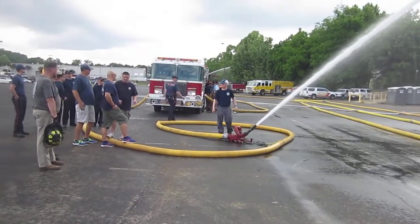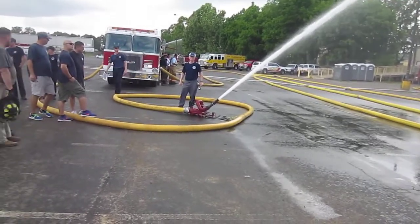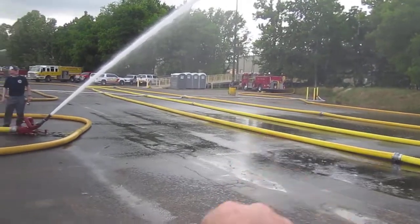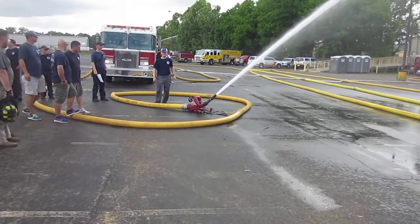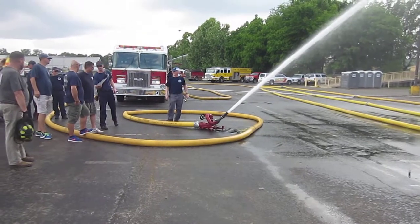This pumper simply is just being a valve and we're flowing about 865 gallons a minute. So 150 discharge, 2,200 feet of 5-inch through a couple devices and we got 865 gallons a minute. Excellent demonstration of 5-inch hose and its capability.